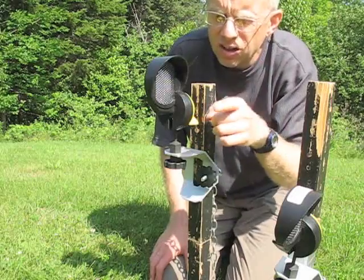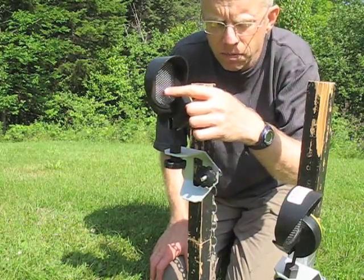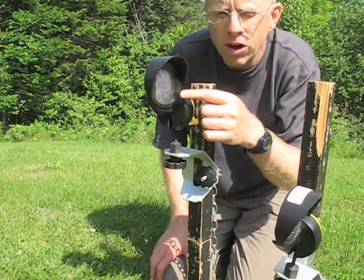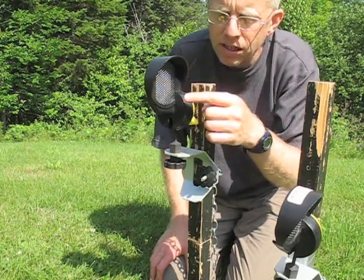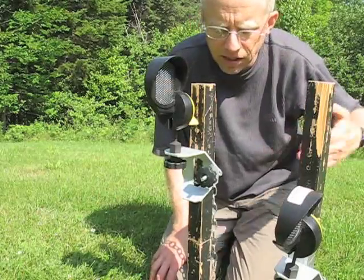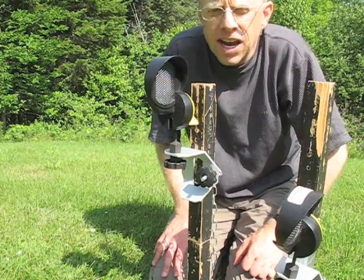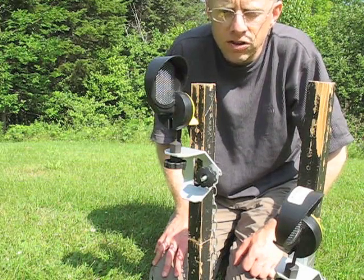Since it's got to go twice as far, and since it's got to reflect off of a surface, you are going to lose more and more intensity of the light, and that's going to mean that your finish line can really only be about 25 meters across, and if you're having heavy snow, you could have more false finishes.